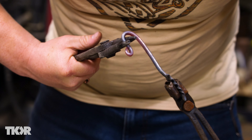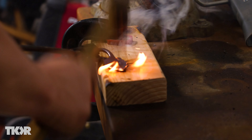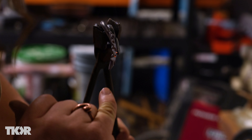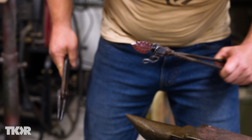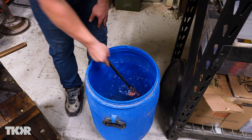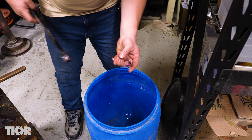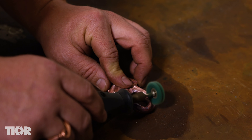We're going to heat this up again and I'm going to start curling the rest of the stem — this is just wherever you want it to end up. Maybe I want to put some curvature in here. I'll just bend it just slightly — just a tiny little bend and it gives it that nice recurve. Now it's time to heat up the whole thing and dunk it in the water. As pretty as that is, I do think I'm going to buff it and we're going to bring out that bright, shiny copper color.